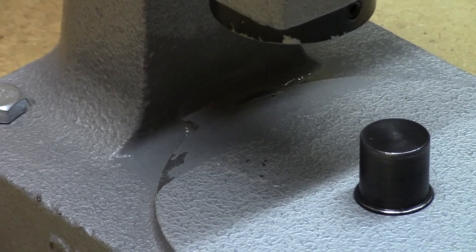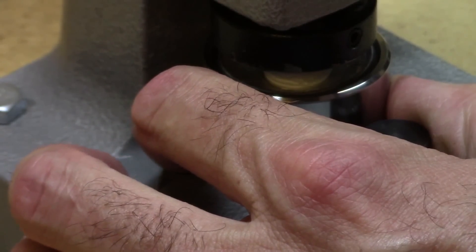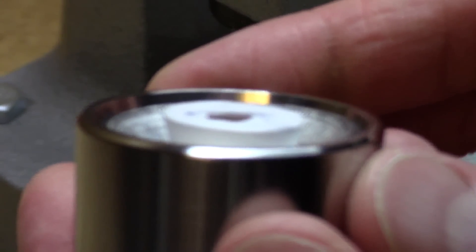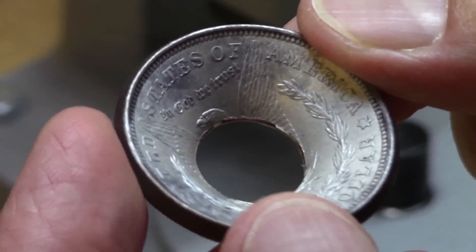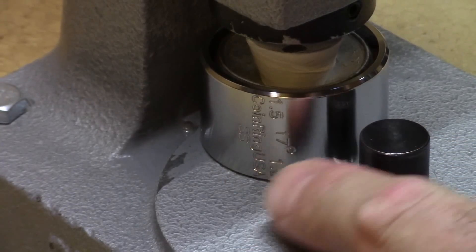As you can see, there's no metal-on-metal contact whatsoever. We'll continue with the process — flip it around to the 1.5 side, get that nice and level, and press. That's what it looks like. You can see further compression of the Teflon tape without any sacrifice to that inner detail. The coin has been re-annealed and I'm now switching to the second size — the half-inch folding cone — still on the 1.5 side.